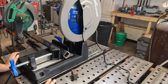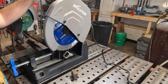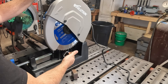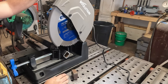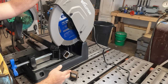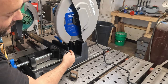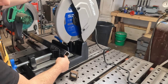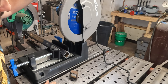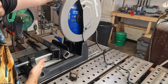When I go to cut this with my abrasive saw it's probably a two-minute ordeal — it's glowing red hot, spewing sparks all over my shop, and then the workpiece is so hot I have to pick it up with my blacksmithing tongs. I can't even touch or use it, and then I have to go over to the bandsaw or the grinder to clean it off because it's smeared the material. This is just a beautiful cut.